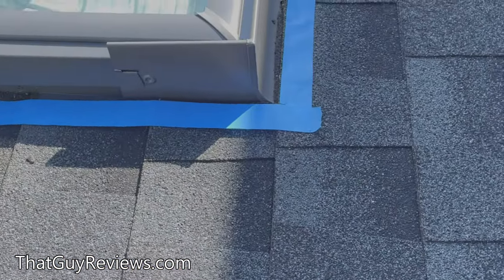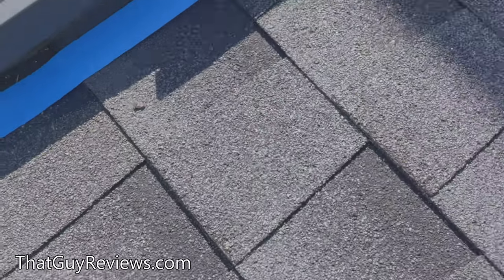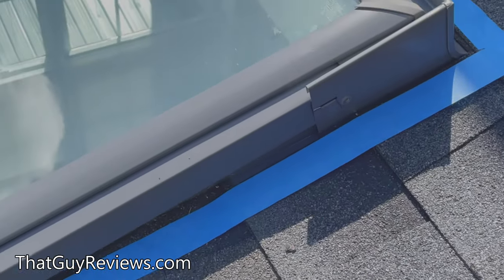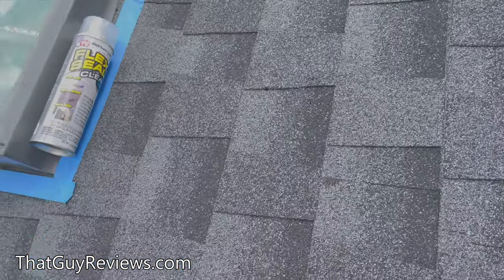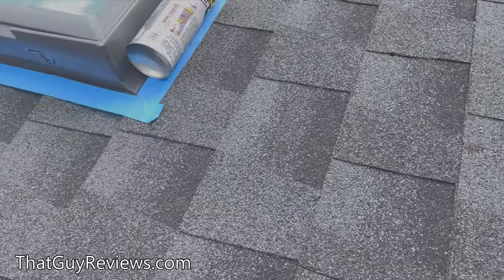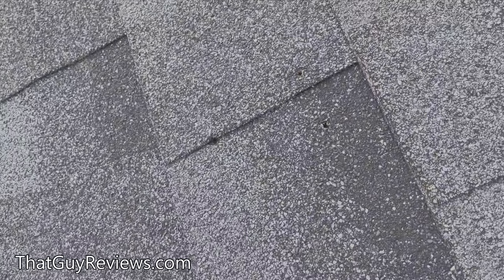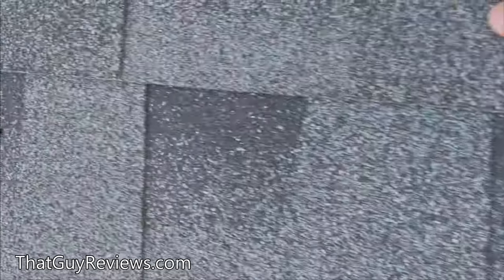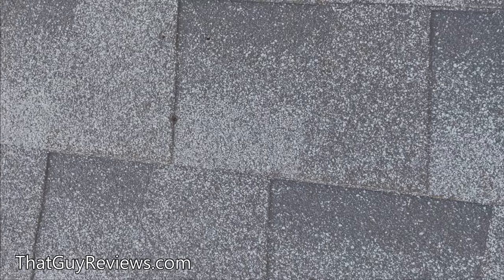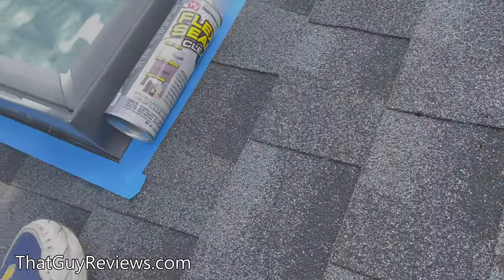I was able to tape up at least a little bit of the corners, and that's where the leaks are coming down from. I've done some inspecting of the roof here just to make sure there's no nail pops that could possibly be causing the corner leak. It doesn't seem to be the case, with the exception of maybe these holes that we discovered in the shingles that might be causing the leak. It's been about three years and we haven't had an issue, so maybe over time it built up. I'm going to try to fill that out to see if it helps the situation for the next time it rains.